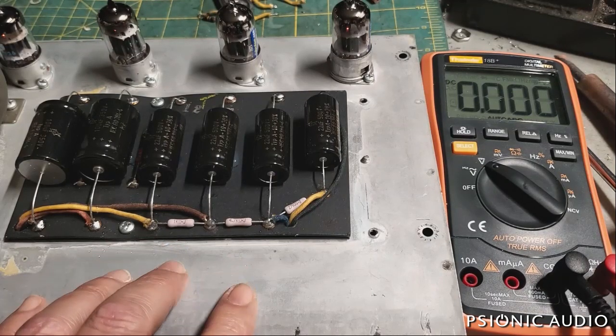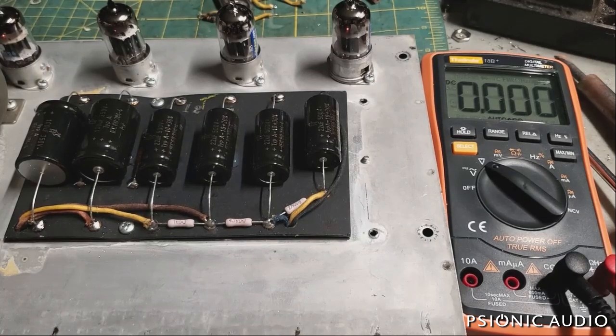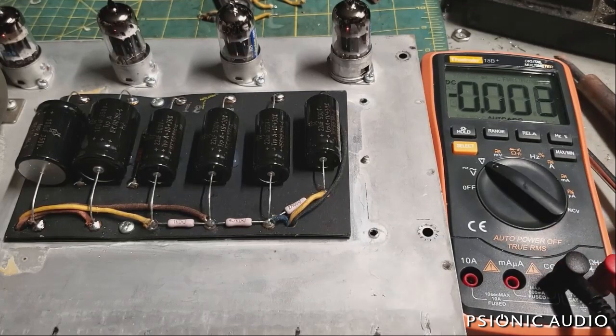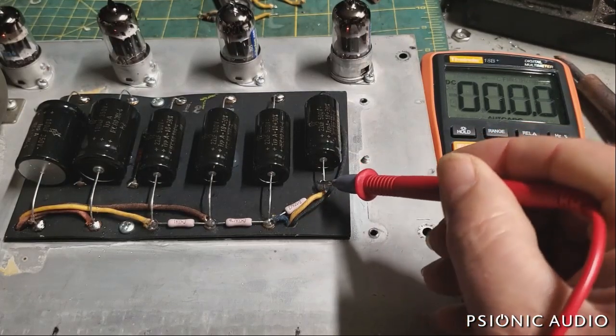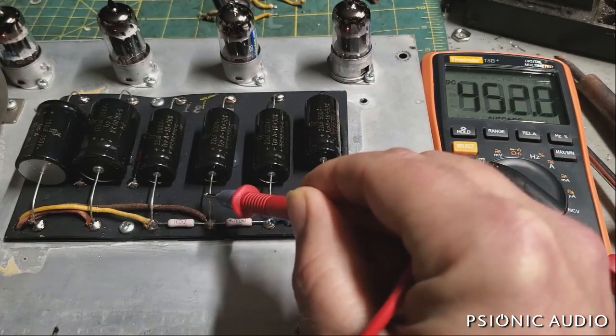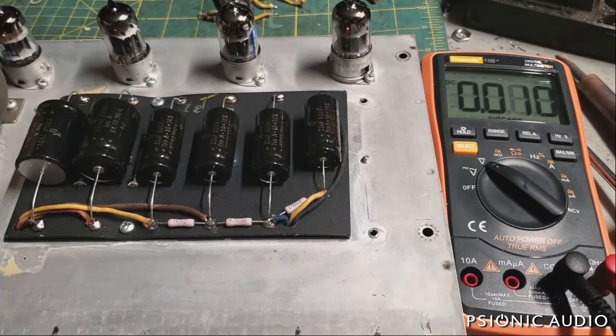In general, I'll tell the owner of this amp that standby is optional — it's not really needed at all. Remember though: on other solid-state rectified amps, standby can be needed because the voltage can exceed the ratings of the capacitors. I hope this answers some questions — I'm sure it will raise questions I'm not aware of, so please put them in the comments. I love talking to people about amps. I've been stuck in the hospital for a week and couldn't talk to anyone there about amps.